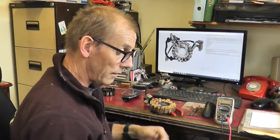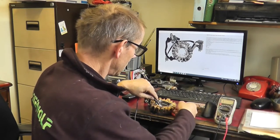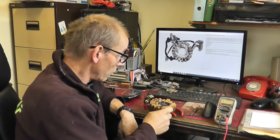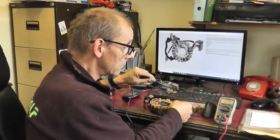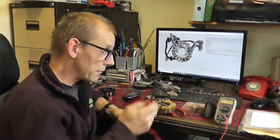Let's put that up there on the ohms meter — there we go, we're showing 134 ohms on that. So we're getting some kind of continuity between that coil there and ground, because there should be no continuity to ground at all, even though we're getting five to six ohms across that coil. Technically the coil's alright, but it's grounding out somewhere in there. As I said, these run dry — moisture gets in and it short-circuits out. So yeah, I think I've pretty much diagnosed it.